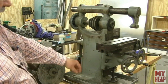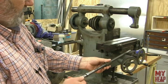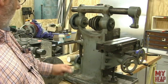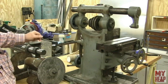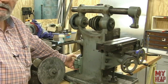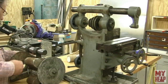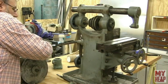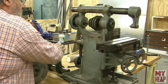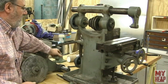Over on the other side of the machine, the lead screw for the X-axis gets bolted to the saddle and feeds the table back and forth. It has a couple of collars and the handle. On the back side there's a casting that gets bolted to the machine — that would clamp down on what I'll call the motor shaft for lack of a better word. The motor shaft slides into that casting, the motor mounts on there, and the pulley drives the spindle. This casting allows the motor to slide back and forth to select the pulley step.